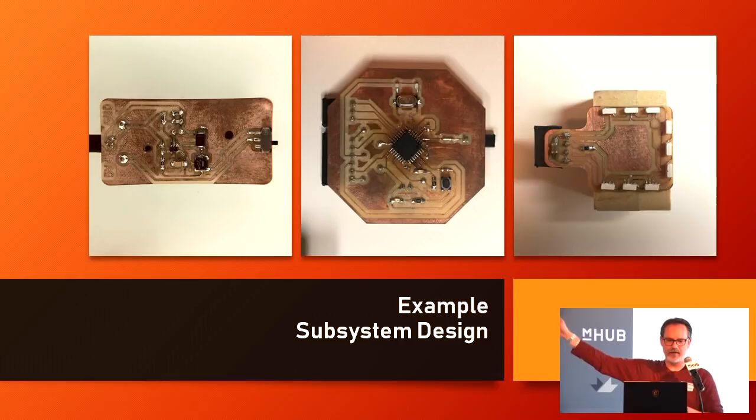This right here on the left-hand side is a boost converter that fed into a microcontroller in the middle, and on the right-hand side were some really awful WS2812 side-fire LEDs that I never recommend anybody work with — the pin pitch on those things is awful. Trying to solder them is like having a tube sitting on top of another tube, trying to get it to stay still.